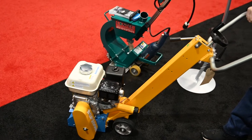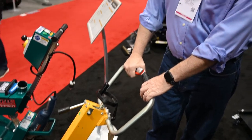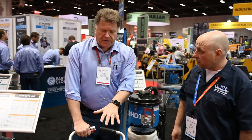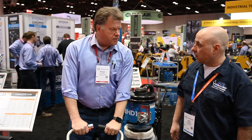There's a safety feature here — if you let go for any reason, the machine will shut off. It's an instant kill switch. Depending on what you're doing with the cutters, if you let us know, we can suggest what kind of cutters to use. This is an eight-inch path machine, but you can set up with spacers if you're only doing four inches, like when you're taking up epoxy.